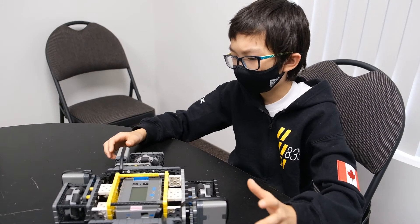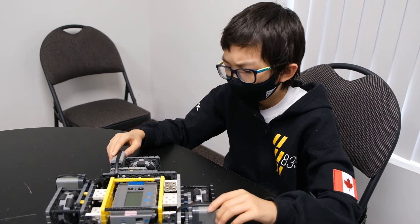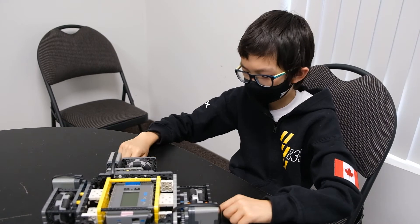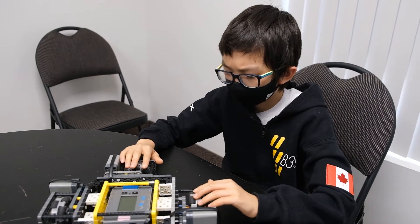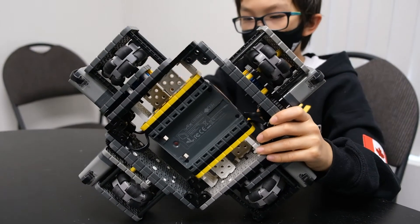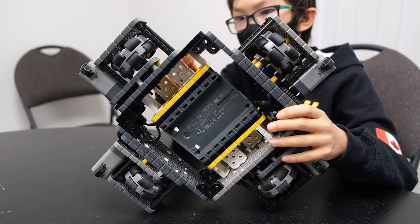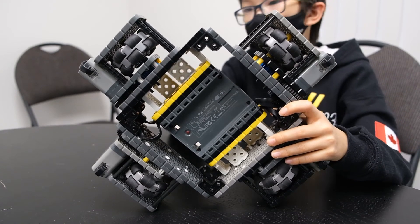Typically X drives are usually flimsy, they're tall and they have a bad center of gravity. For our battlebot you wanted it to have a low center of gravity and be as low as possible so you won't get flipped. We also made it really sturdy — instead of using an X as a chassis we used a square, because the square was easier to make and a lot sturdier, especially when you use the brain as a brace.